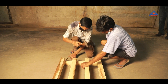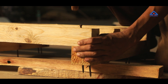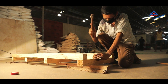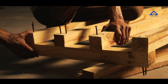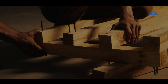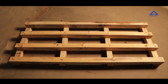Nails should generally be placed at a distance of about 25–30 mm from either of the edges. In all, 28 nails should be used for the fabrication of one pallet and hammered without causing splitting of the scantlings. The nails are driven 3 mm inside the wood so that their heads are not protruding on the surface. Each nail is clinched not less than 25 mm and flushed with the bottom surface of the scantlings.